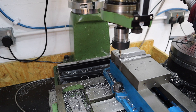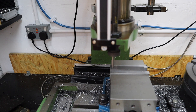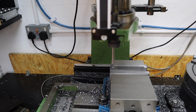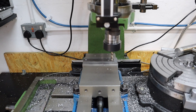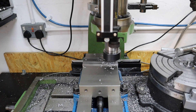This furthest hole, which is going to be acting as our pivot hole, needs to be reamed to a quarter inch. I've drilled it out to 6mm and am going back in now with the quarter inch reamer. Once that's done, I can then move across and drill out the other hole - this is eventually going to become a 6mm tapped hole, so for now I'm going to drill this out to 5mm and leave it there.